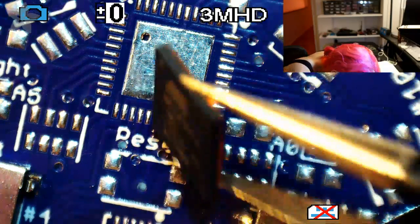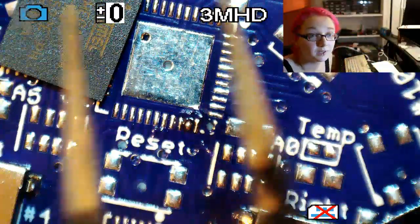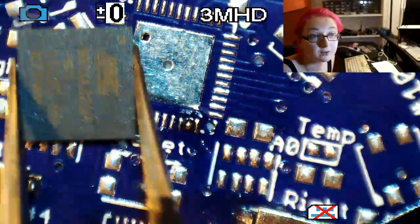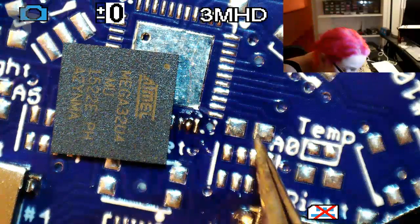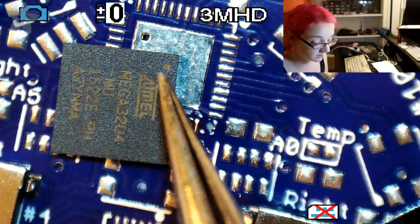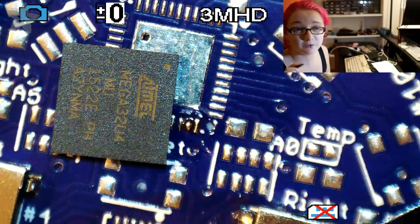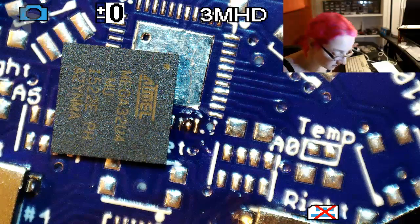All right, next up we want to align it correctly. That's the worst, if you solder on a chip and then you realize that turns out not to be the number 1 pin. Okay, that's the number 1 pin. You see it's a dot. It doesn't always have to do with text alignment, so make sure you look for the dot. Also, another thing about QFPs, they tend to have 2 dots. One's a molding dot and one's the pin 1 dot, so watch out.